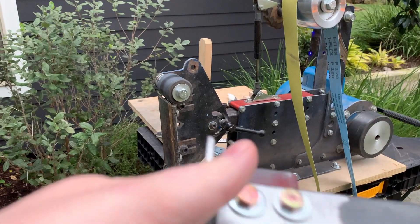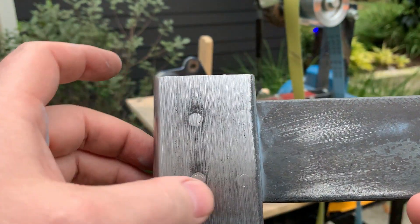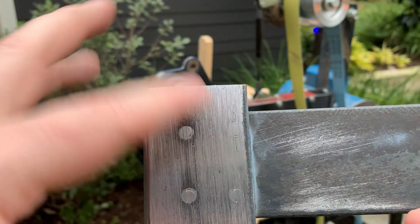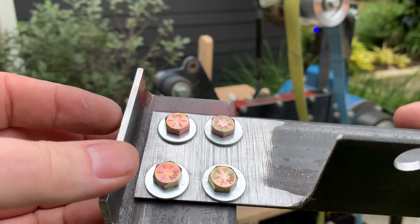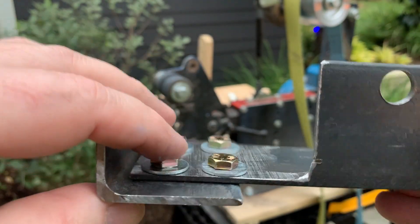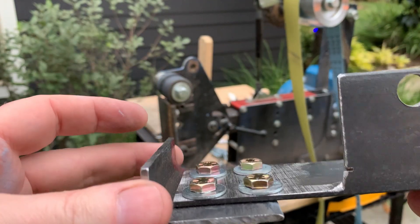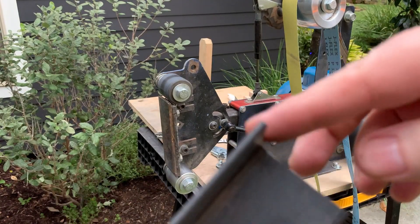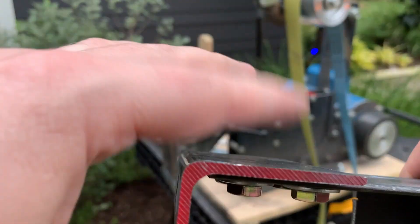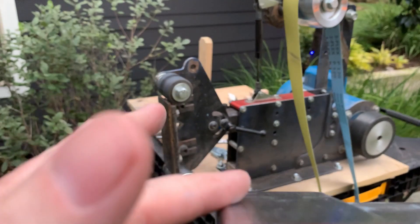Since I can't weld, I made four quarter-inch pieces. I threaded this part, and when I put the bolts through there I just ground them flush, and they're on there pretty tight so hopefully that'll hold. Because this angle iron is too thin to make a nice radius, I bolted on this piece of angle iron and put my radius right there.